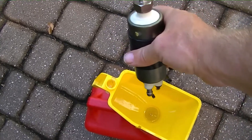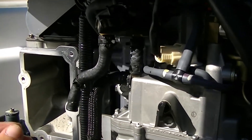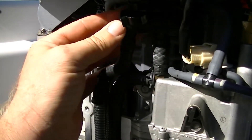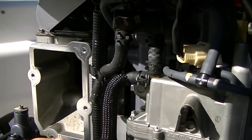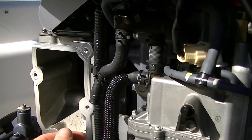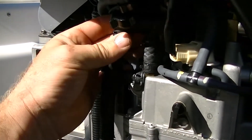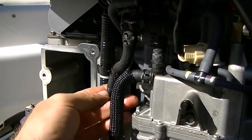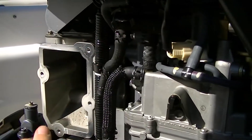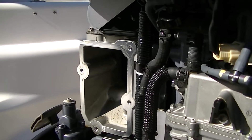When I disconnected the hose to this fuel pump, there was still gas in there. I took this line going to the filter and blew into it — I have air that can go through, so I don't have a clogged filter because I can blow through it pretty easily. I don't have a clogged line, and the hoses aren't too brittle — they've been well protected from the sun and salt water. My guess is that the part I just took out, the low pressure fuel pump, is probably the culprit of why this thing wasn't working.